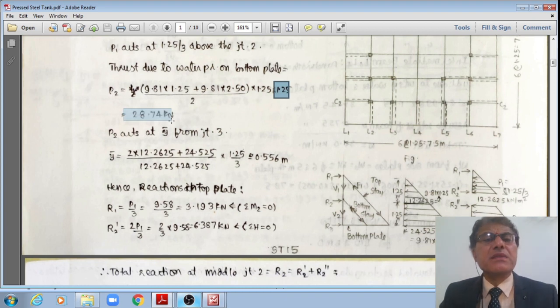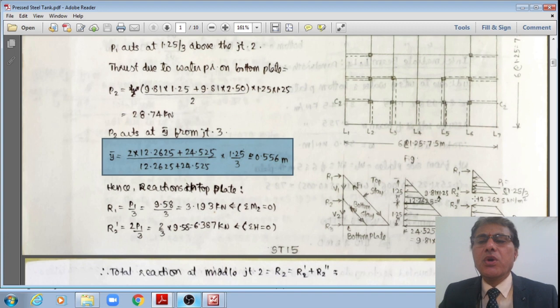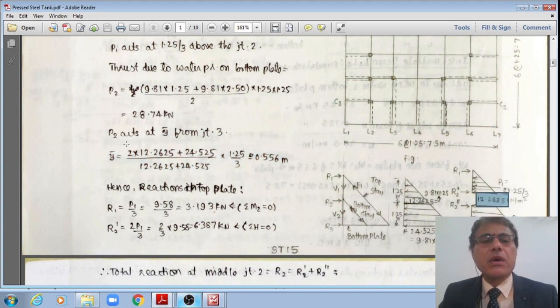Now I'll get 28.74 as P2, acting at a height of y bar. From the trapezium CG formula, y bar is equal to (2a plus b) divided by (a plus b) multiplied by h by 3. That is (2 times 12.2625 plus 24.525) divided by (12.2625 plus 24.525) multiplied by h, where height is 1.25 divided by 3. It now works out around 0.556 meters